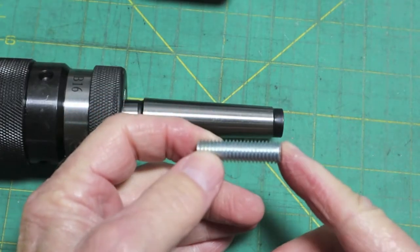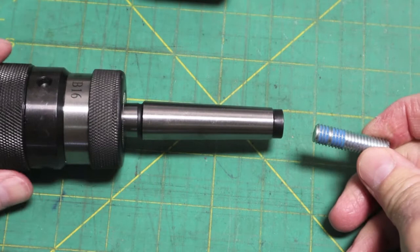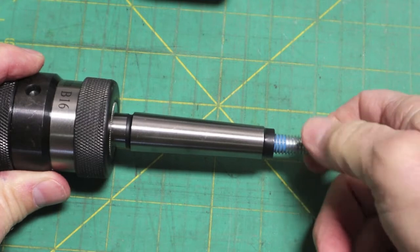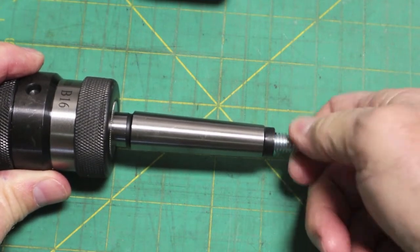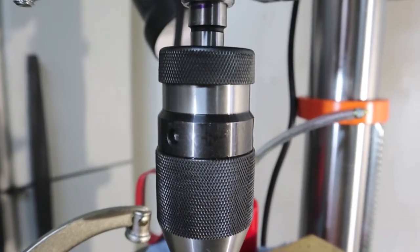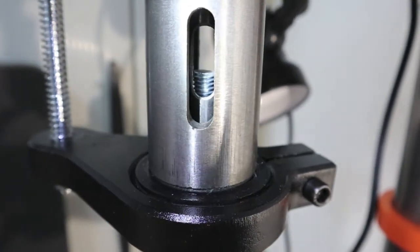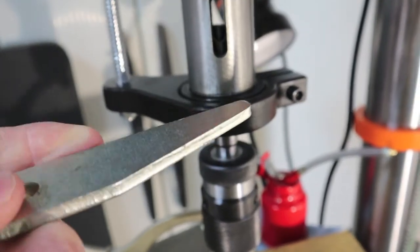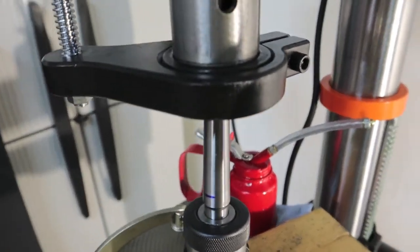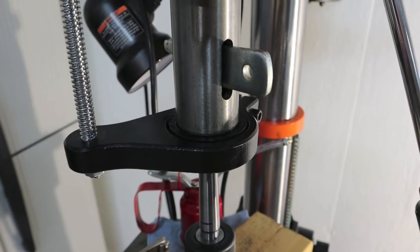With the head cut off, it's right at an inch and a half long. Put some 242 blue Loctite on it. This one has about a half inch sticking out. We went ahead and just slipped it back up in there — it has not been tapped with a hammer, and it's got plenty above it. Now we get to use the tool that's designed for it. I never tapped it up in there; it's going to work fine. If you have any questions, please don't hesitate to ask them in the comment section. Thank you for watching.